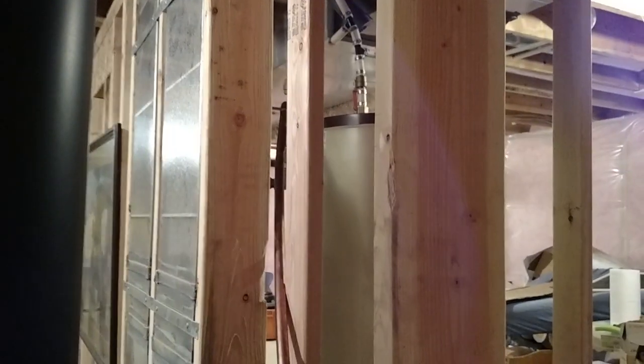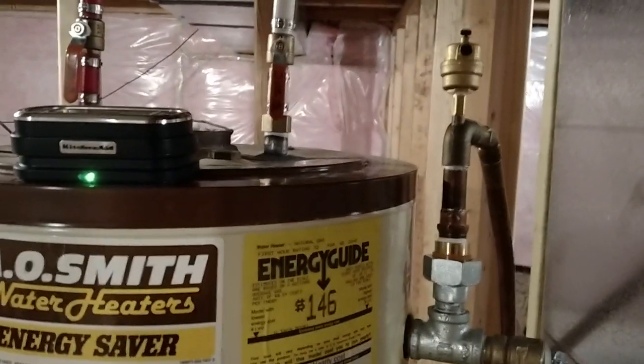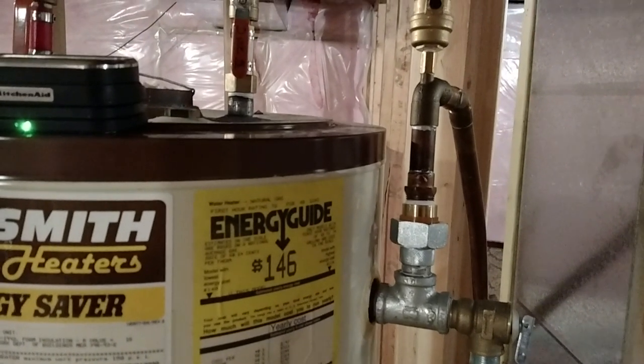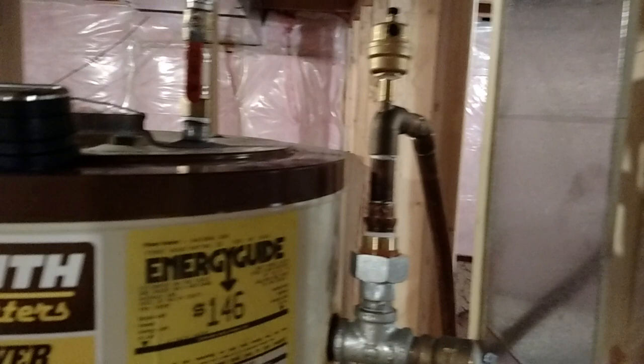Got unions there, and they lead to this extra tank that I purchased off of Craigslist. The idea is to create a thermal siphon. Thermal siphon is hot water rising through the pipe right there into the tank, and on the bottom it sinks down toward the wood stove, and it just starts to do this cycling all on its own. And it'll heat this water tank up — the temperature will just keep rising.